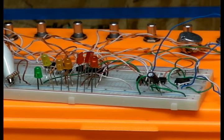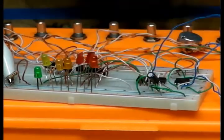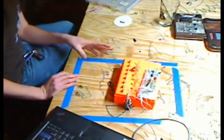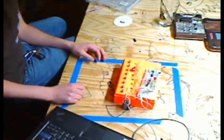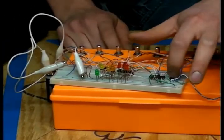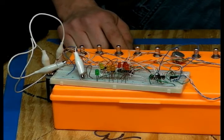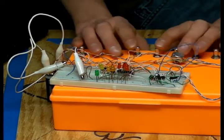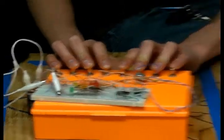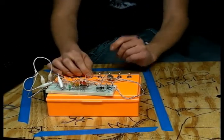So yeah, basically it does the same thing. You just need some sort of on-off voltage. And actually, 9 volts might be too much, but basically the 555 does exactly what it needs to do and advances the 4017. This is a whole different lecture in itself. How to build a sequencer is not a difficult thing, but I don't want to talk about it.